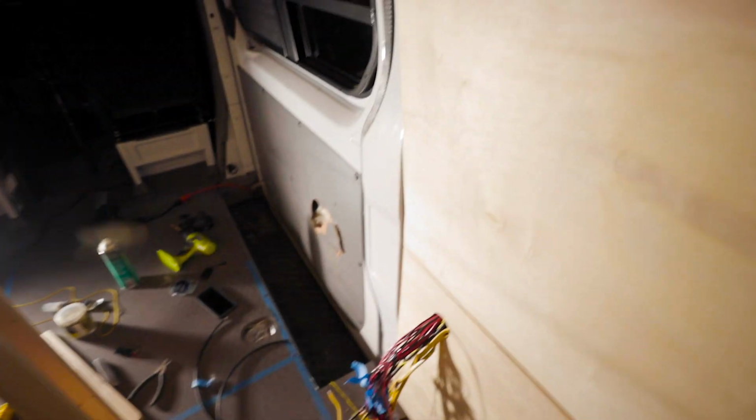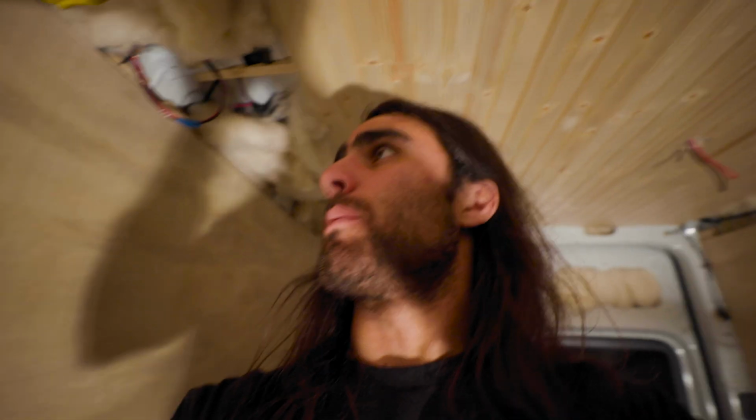We brought all of our wires through this hole here so we can have a nice clean area down there. I am just going to screw these down. I'm using number 6 by 3/4 inch wood screws. So we couldn't find a finished screw or a trim screw that looks really nice that's less than 1.25 inches for some reason. I just don't think it's meant for that. So I went with this wood screw. We're burying it pretty deep into the wood, and then when I paint it, I'll fill it and paint over it, so hopefully you won't see the screw head in there. But I'll cross that bridge when I get there.